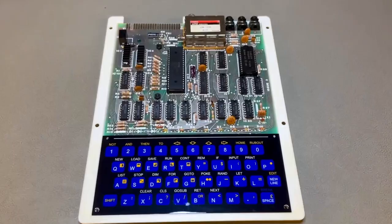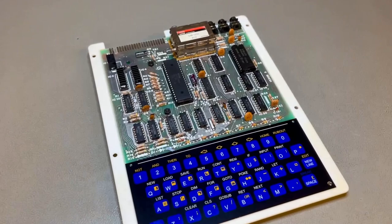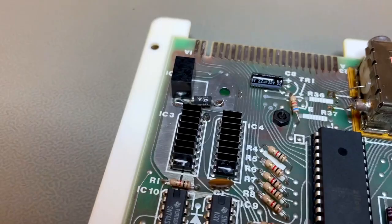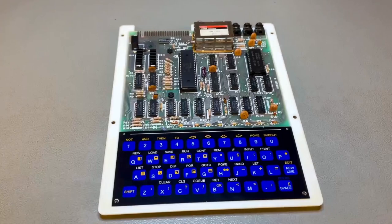If you've done all this, the composite mod will be hidden under the can — there's no RF modulator there, but it will work as a composite output and will be invisible. The other modifications are more conspicuous — you won't have that big heatsink of the original linear regulator anymore — but even then they're not too conspicuous. Everything is black, everything is tucked in a corner of the board, and the computer will largely still look much like the original when it comes to the PCB.